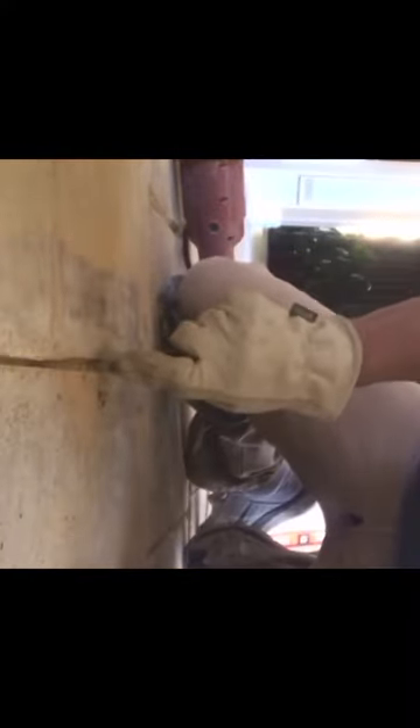Take the vacuum and get some of that grout out. Next, take your blade and slant it slightly over the chiseled edges to get some of that out. We'll use something chemical later to get most of it out. Make sure you get the edges here, because you don't want this popping up when you put your new color in. Get these edges just slightly — you don't want to scratch it or leave any marks.